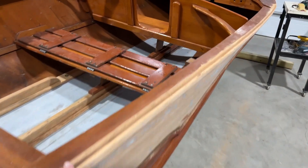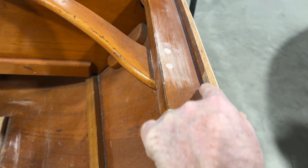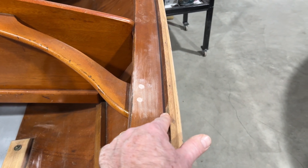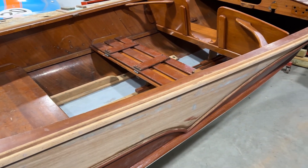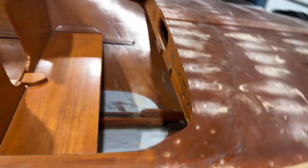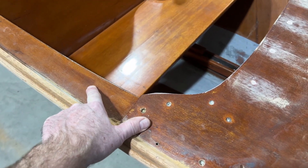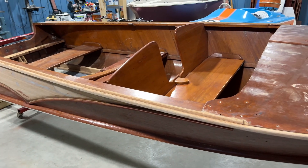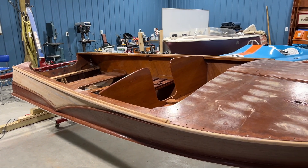One of the reasons I decided to take this down was this — right here is where the epoxy failed, right down to the wood. On top of that would have been stain, epoxy, and several coats of varnish, so I would have had to fix that, which would have meant it never would have looked right. There were lots of chatter marks on that rail — it had a lot of abuse just from wear and tear. It's not necessarily malicious, but I went ahead and did the other one already. I'll do that one, and when I do the deck and covering boards, they're natural while these were stained. I'll try to do some blending because it goes right into the interior, which was done natural and is just getting scuffed. So we'll try to get a nice transition and do the best I can.